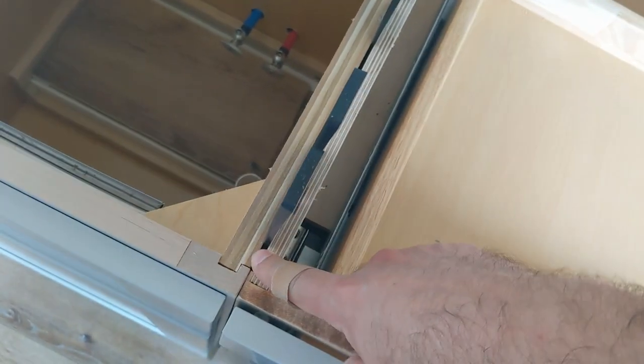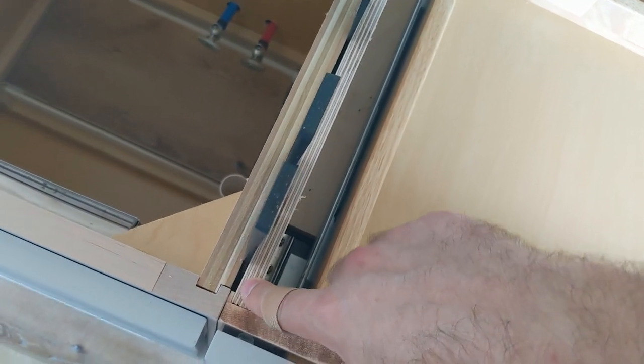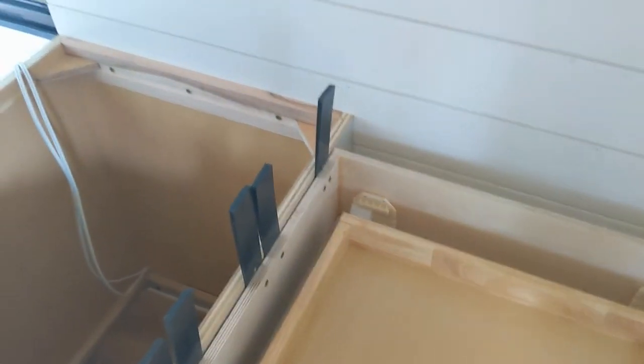Alright, I've got this drawer mounted here on the left. I have 6 screws going into the adjacent cabinet, and this is shimmed, of course, because with furniture end on cabinet, it gives it a little bit of a space. Obviously you don't want to compress this wood too much, it will strip the screws out. I know that from experience.